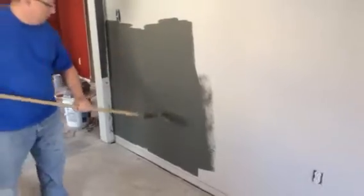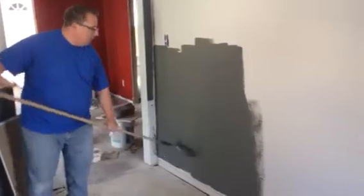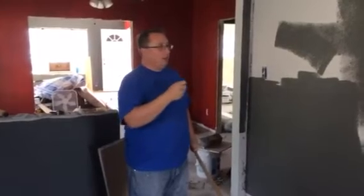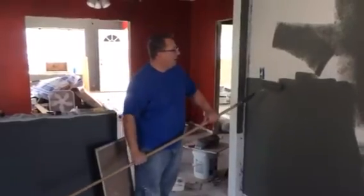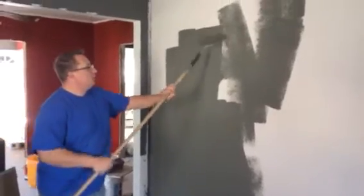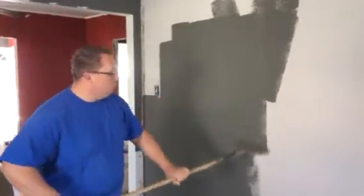Now, if you've watched any of those do-it-yourself TV shows where they paint the room, you'll see them paint all kinds of crazy ways. That does ensure coverage, but it wastes a lot of paint because you wind up going over the same spot more times than necessary. I promise you, if you buy a paint and primer in one and your wall is either a lighter color or a similar color, you can cover it in one coat. The only thing you might have to do is go back with a little bit of touch-up on some spots that are just a little bit white, or maybe your paint didn't quite get into the cracks — especially on a textured wall like this.